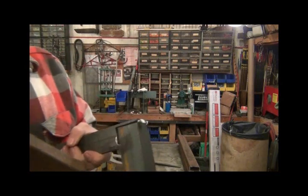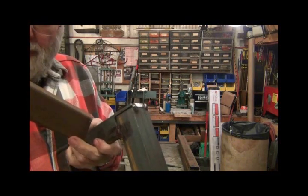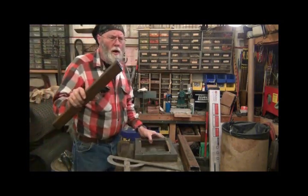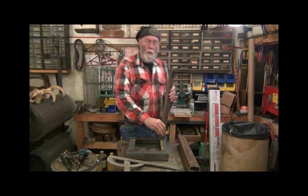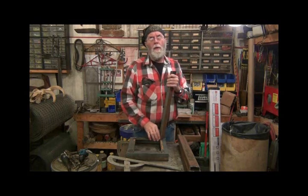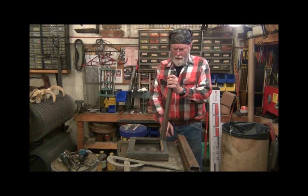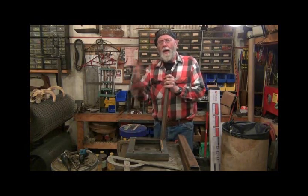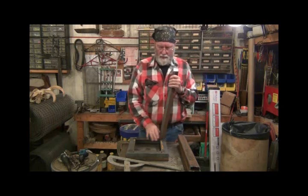Basically, I'm going to put this leg on this side of the corner here. This edge will be against that corner and then kind of centered up on there. I want the legs on a 15-degree angle, and instead of being way out like this, I want it to be more forward — a 20-degree angle. Put the corner here and the other side on this corner, putting the foot out more underneath the horn and the heel. I don't think I have to worry too much about it tipping over, but I'm still out past the side where the anvil is going to be setting.